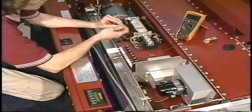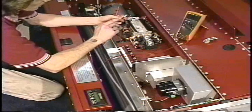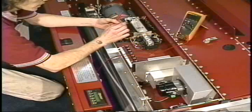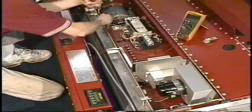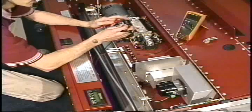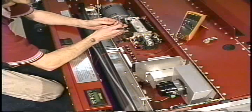You'll notice that this is not a fuse you can see through, much like your drive motor. Your drive motor is a ceramic fuse, therefore it needs to be checked on a meter. Always make sure that when checking a fuse, you're not on any type of metal surface. You're better off on a wooden workbench or actually holding it between your hands.